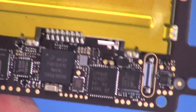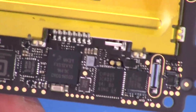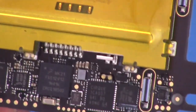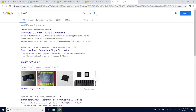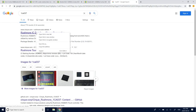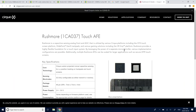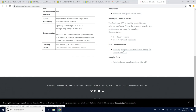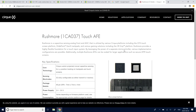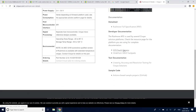There's a 'Cirque' labeled part - 1CA037. Let's do the same search. There we go - touch sensor. So I don't know if this is part of some security stuff or this is literally just the touchpad being done through here. I'm not really sure - you'd have to pin out where all this goes. It seems a bit funny to find it inside this security area.